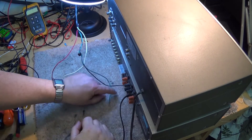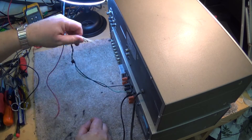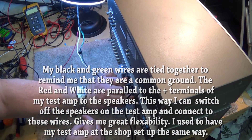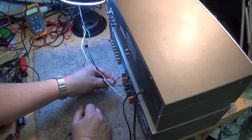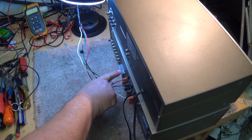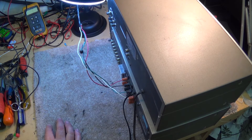You'll notice the speaker connectors here — you just stick the wire in and give them a twist. This is an old school type of connection, not necessarily the best way to connect your speakers. I prefer the real binding post, but again this was not a high-end amplifier. The speakers are protected by 3.3 amp fuses, so at least the amplifier had some form of fused protection — if the speaker leads shorted, hopefully the fuse would blow before there was a problem.